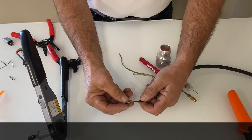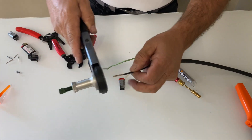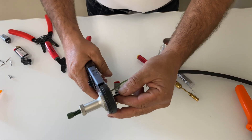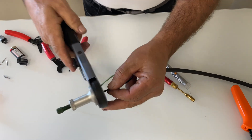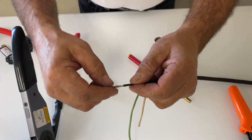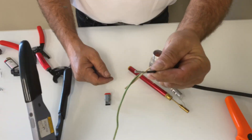All I'm going to do is install it on the end of the wire — I've got a little bit of wire showing. Slide it into my crimper, squeeze down, and it'll actually hold it until I go past center and then it releases. We've got a nice firm crimp. Next I give it a good tug to make sure it set up properly, and now I'm good to go.